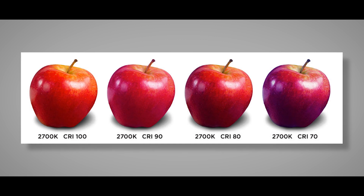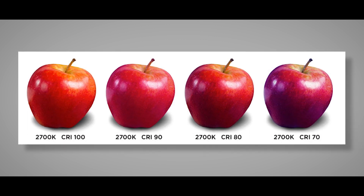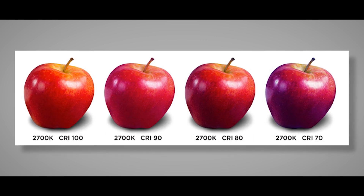Finally, we have CRI, or color rendering index, which exists on a scale from zero to 100. It tells you how accurately the light will render colors, using daylight as a reference. For example, take an apple viewed under 6,500 Kelvin sunlight — that's what it should look like. Depending on the CRI value of your light, it will either render colors accurately or make them look more faded and less vibrant. A CRI above 80 is considered good; a CRI between 90 and 100 is considered excellent, giving very accurate colors. Below 80, you could be getting into trouble — if you're buying budget lighting off Amazon or doing DIY work, check the CRI to make sure it's not super low, or you might get really faded, inaccurate colors.